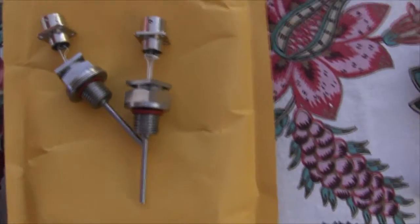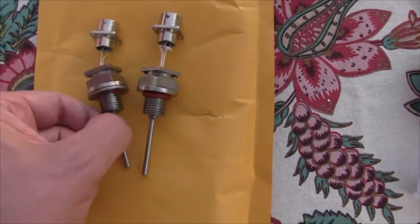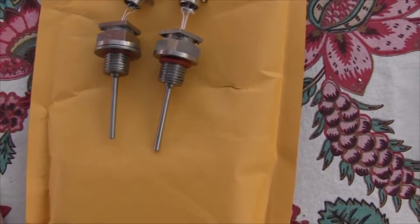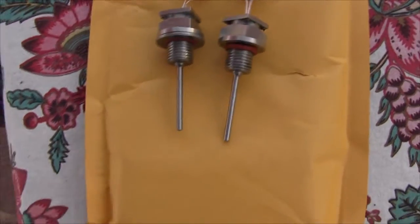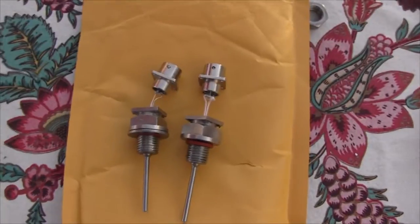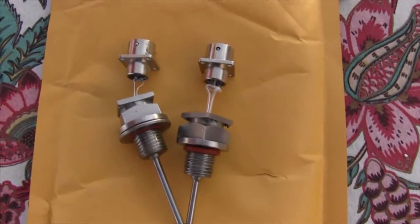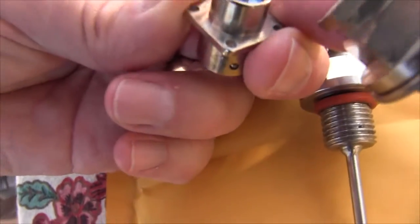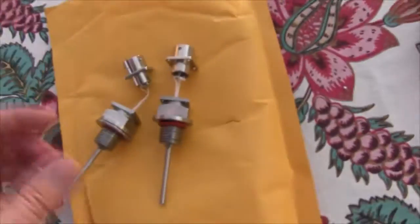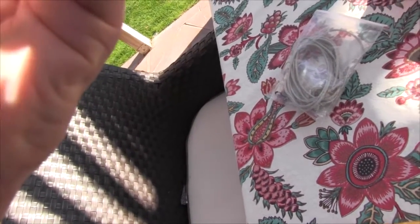I thought I'd try to explain what was going on with my probes. These are two RTD liquid-tight sensors or probes — two inch and weldless. The problem I had when I put this system together originally is these are wired differently, and that really caused me a lot of trouble. This one here — the two that are in common are one and two, and on this one the two that are in common are three and one.